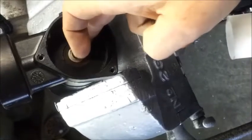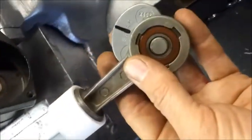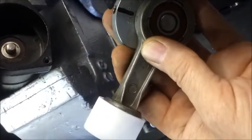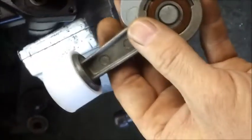Make sure that this shaft's flat is vertical and pointing this way. The next step is to scribe a line on the counterweight which denotes the position of the grub screw hole in relation to the flat on the shaft.